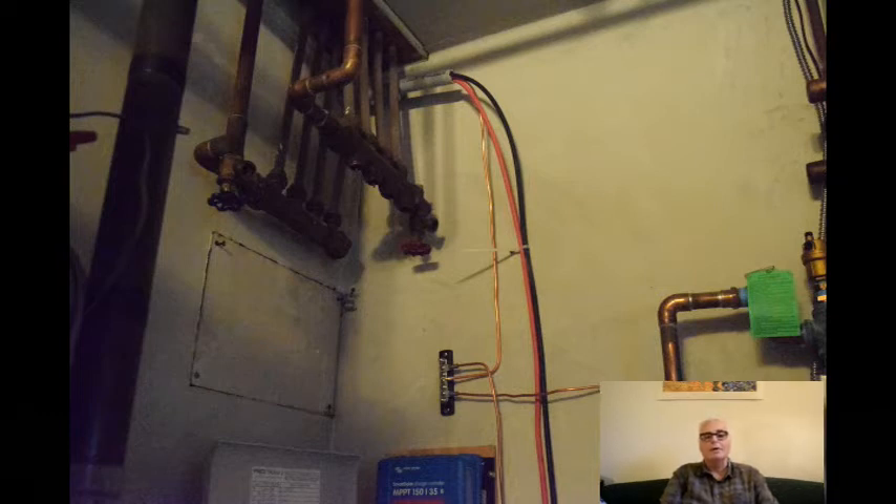This picture shows where the solar lead wires and the ground wire exit the conduit in my utility room. The wires are fed down the wall — the lead wires go down to the next group of components and the ground wire goes to a small bus bar. I wanted a connection point for DC system components that need to be grounded. It was a real pain to feed the wire through the utility room because of my heating system and all the paraphernalia associated with my well, which were in the way. So I split the wire there and connected it to the bus bar. The bottom wire on the bus bar goes down to the floor and across and out through the back wall to where the ground rod is driven into the ground.